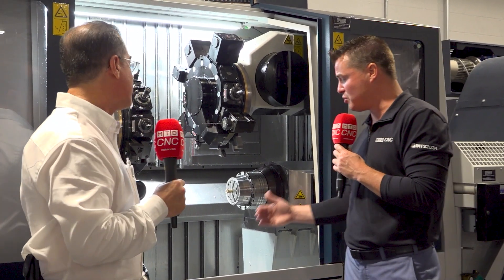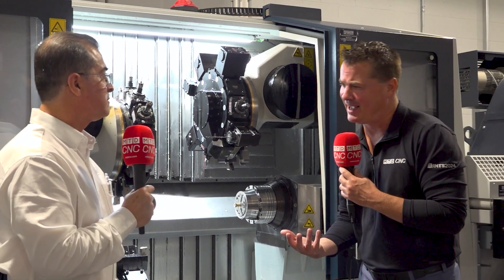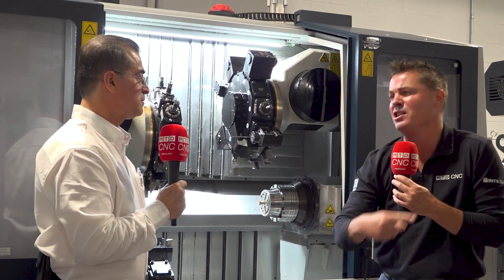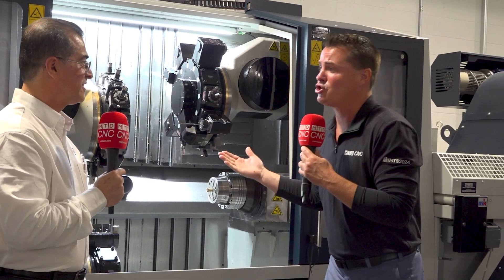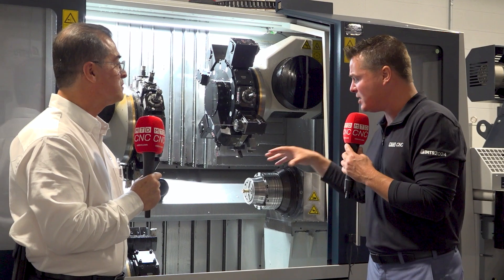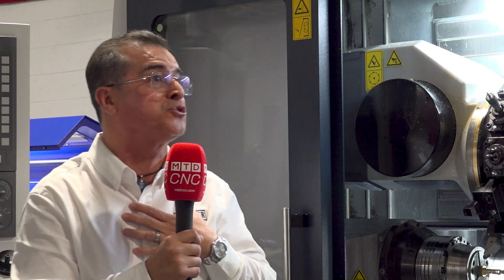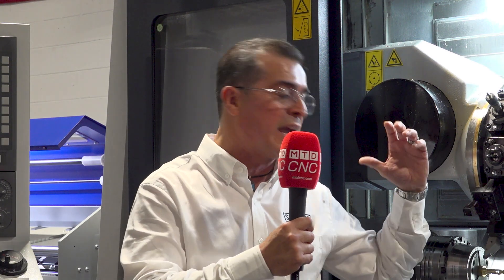Let's quickly touch on something that's important — you mentioned the width of the chip conveyor belt. I know how chips can build up, and if you have any stringy parts it gets real annoying if you're not getting the chips you want. So let's talk about the wider conveyor bed and what that helps. It helps get the chips out — even when you get the stringy ones, the bird's nests as we call them. I always put myself in the shoes of the operator. I've done this since 1990 and I started from the bottom up as an operator — that was one of the issues. So when I'm thinking about an application, I look at the problems that customers can get. The chip conveyor specifically can get all those big bird's nests out of there a lot easier than a narrow chip conveyor.